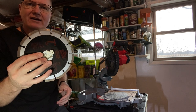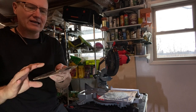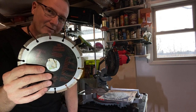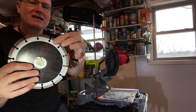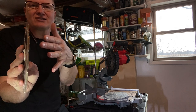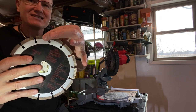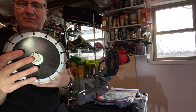There's blades out there that look like this. This is not meant for wood. This is a masonry blade if you're doing tile or cutting brick. They will say on it: concrete, block, brick, masonry. It's a fairly thin blade, about the same diameter, but it doesn't have that kind of kerf tip which we'll look at on the wood blades. This one has a diamond-studded coating so it can go and cut through blocks much easier.